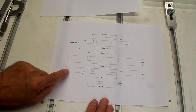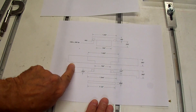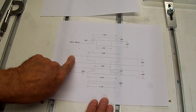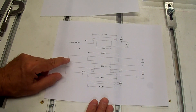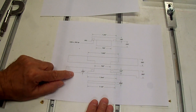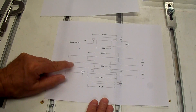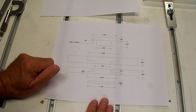Before I do that I need to drill a hole up through here for the screw hole in each corner and into this. So I'm going to place these on the vacuum fixture and spot the holes. I've got a little program written to mark the four corners where these holes go, and then I can drill those on the drill press.